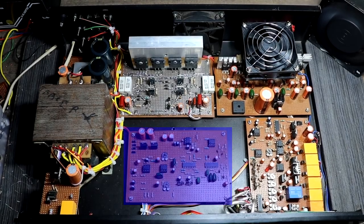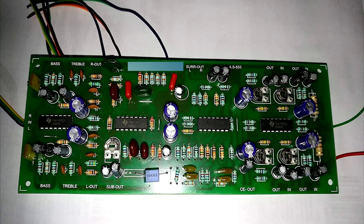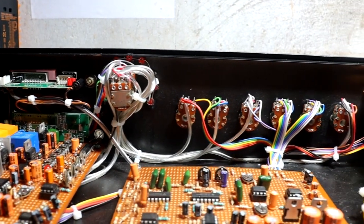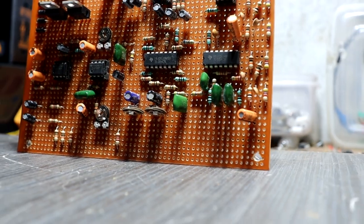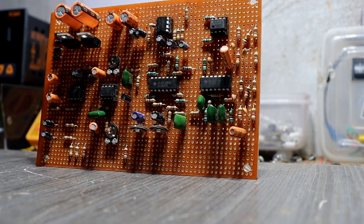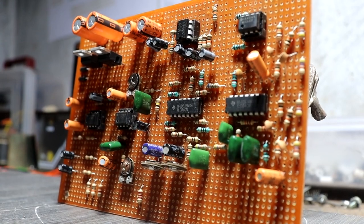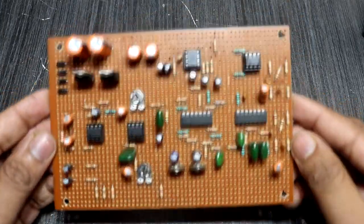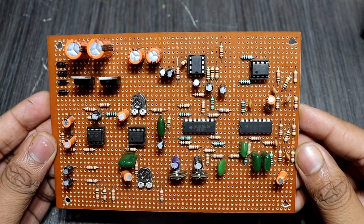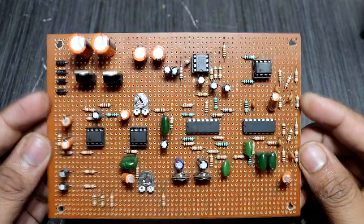And this is the 5.1 decoder board, or 5.1 prologic board. Commonly 5.1 amplifiers must have a prologic decoder board, and our 5.1 amplifier also has one, but this one is an own made prologic decoder board. This prologic decoder module has a subwoofer pre-filter, surround channel controller, and center voice controller. But remember guys, definitely I will share a complete tutorial about this 5.1 prologic decoder board project in upcoming days. And this 5.1 prologic decoder runs on a dual supply. One more special feature I added: this 5.1 prologic decoder has a 3D mode, based on the PT2328 3D sound processing IC.